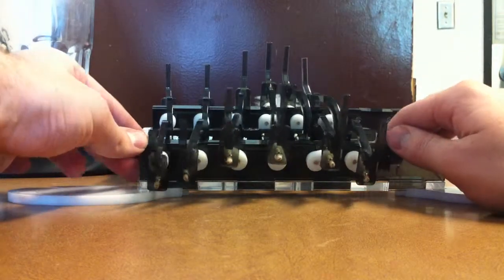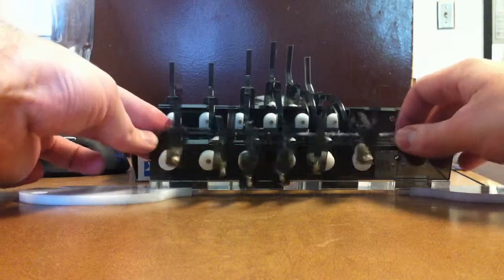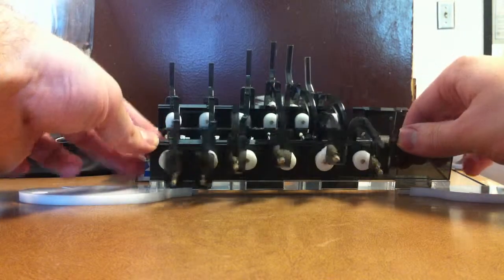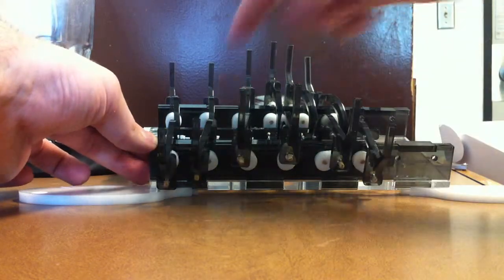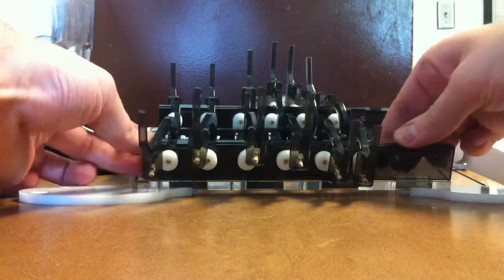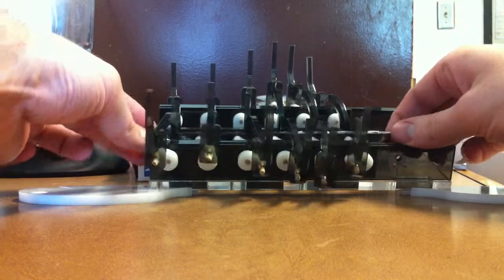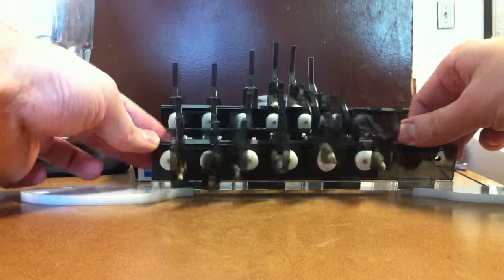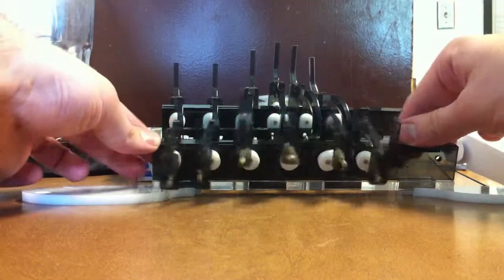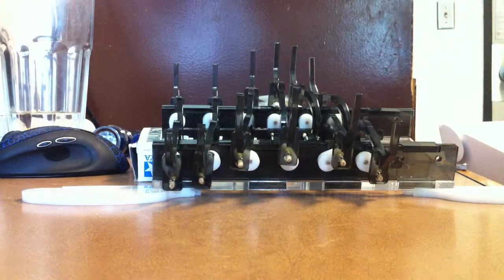That drives a series of camshafts per each individual leg. Each leg camshaft is the white thing. It's offset by 60 degrees relative to the next leg. That's why it looks like a wave — look at that motion.